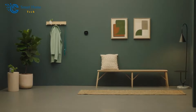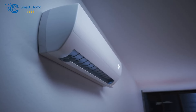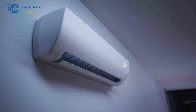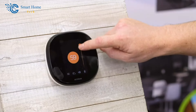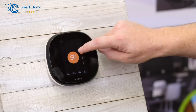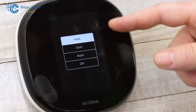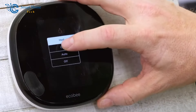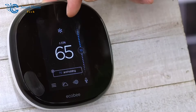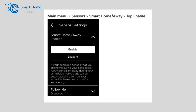Whether Follow Me saves energy depends on how your most-used room heats and cools relative to the rest of the house. If you spend most time in the living room and it tends to be warmer, the air conditioner will work hard to cool it, potentially overcooling the rest of the house — you'll be comfortable but won't save energy. In heating mode, a warm living room will hit the set point sooner and the furnace will turn off, saving some energy but leaving other rooms cooler. Note that no single thermostat can set different temperatures per room without smart vents. Follow Me can be toggled on or off from the Ecobee thermostat, the app, or web interface.